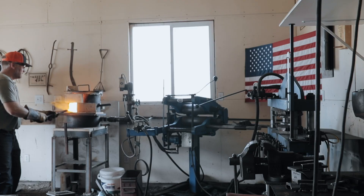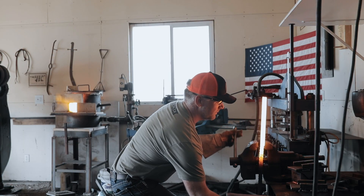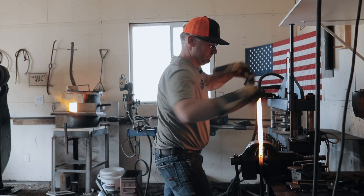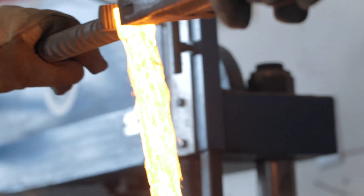We're ready to twist this bar of steel. I'm going to show you how you can twist it at home with a pipe wrench — I just welded a rebar handle on the other end. It's absolutely a good way to go, though you'll see it's a lot of work and it's tough to get it really tight. After maybe a heat with that method, I'll go to my twister and show you my way. There are lots of powered twister designs but mine's pretty cool. Okay, here we go twisting by hand — got to be fairly quick.